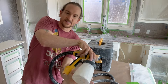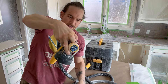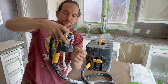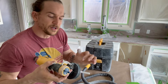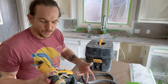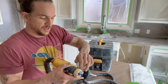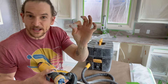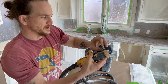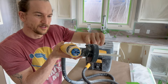One issue is this little tube here — if you tilt your gun to the side the tube is on, paint can hit it and get messy in there, clogging it up. You might not notice right away, but on day two if you didn't clean your gun, you may not get a good spray fan or no paint coming out at all. Pull this hose off — if you see paint inside the hose, that means paint went up and the valve got clogged.